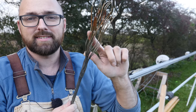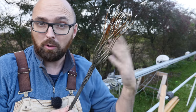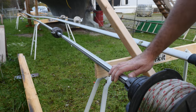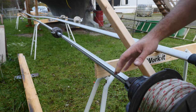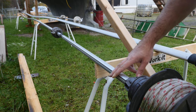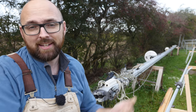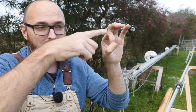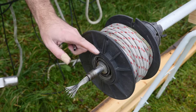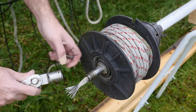This is what Athena's old headstay looked like — pretty crusty. Now we could also, instead of welding the new one onto the old one, have just cut away the outermost strands of wire and taped the two together. The rigger that made the new rig suggested doing one or the other to be able to pull the new headstay through the aluminum profile of the furler, because apparently inside of this there are some little plastic parts. Had we simply just yanked out the old headstay and tried to shove the new one through, apparently the wire wouldn't be able to find its way through those little holes.